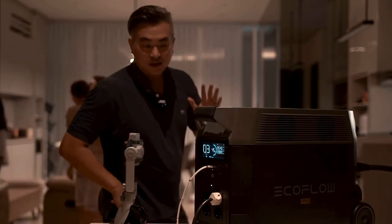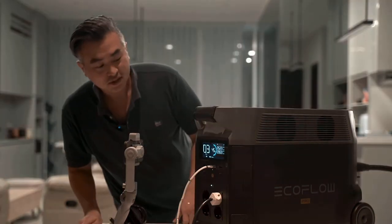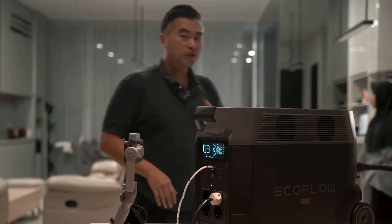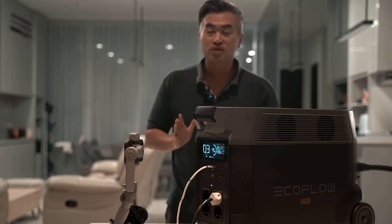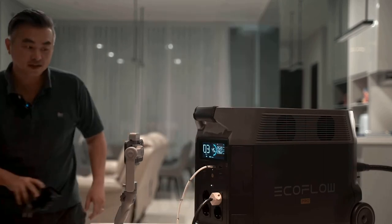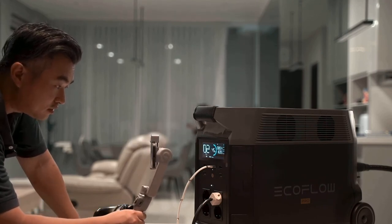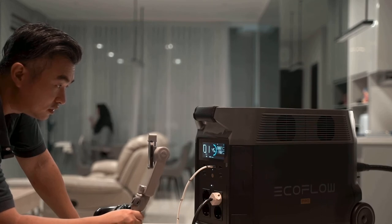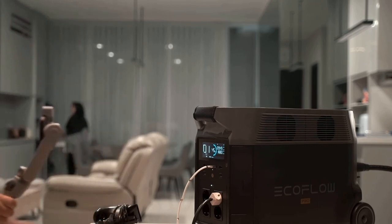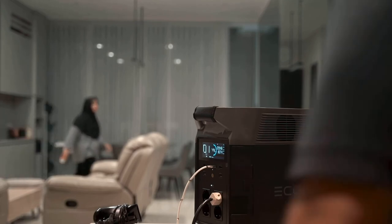Okay, 988, and the smart battery only supplying 500 plus. So the power becomes longer. We'll change to the master bedroom aircon, which is about 1.5 PK, which is about 12,000 BTUs. Okay, turn it on. Okay. It rises up again. The aircon up is on. Okay, it left about 45%. And the smart battery is supplying 2 hours more, 1 hour more.